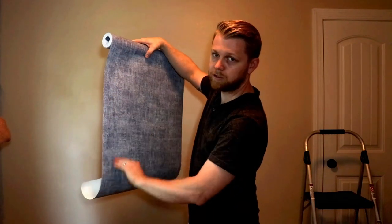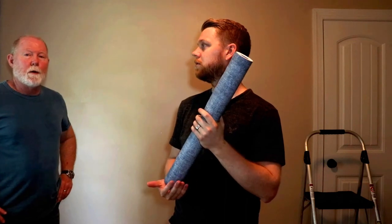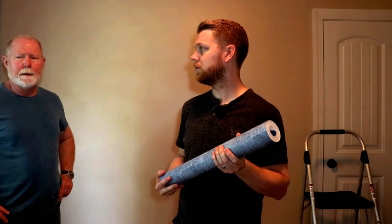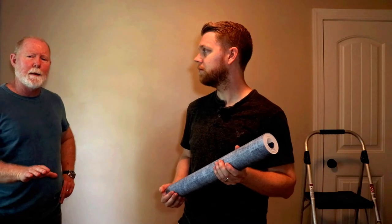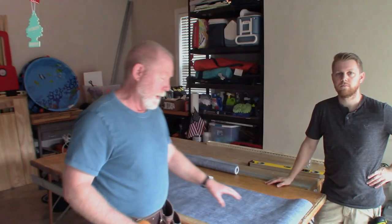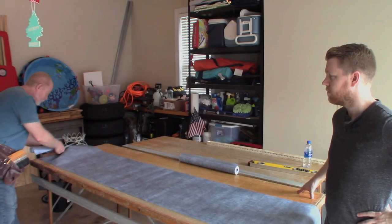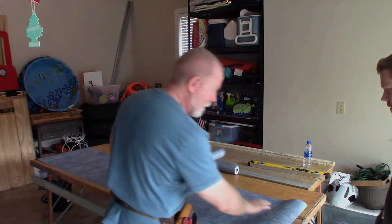Steve took measurements on the wall. You want to add four inches overall — two inches to the top and two inches to the bottom — so that if you cut the whole wall out at one time and the wall is out of level, you won't run out of paper from one side to the other. We've determined we need six pieces. The wall measures seven feet eight inches in height, so we're cutting the pieces at eight feet. It's a denim pattern with a straight match.